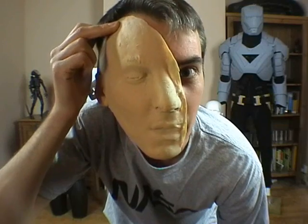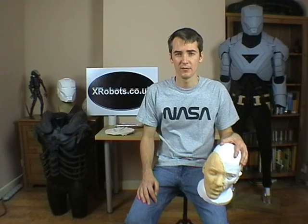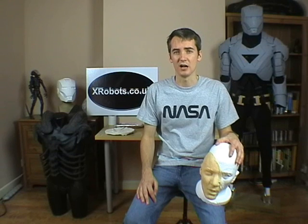In the next example, I'm going to show you how I made this quite weird mask of half my face out of latex. If you've watched my previous video on making latex items, you'll know that the best sort of mould for latex is plaster — because plaster is slightly porous and draws the moisture out of the latex, helping it dry, so the skin forms on the inside of the mould that you can peel out. However, putting plaster directly on your skin is very dangerous. Unfortunately, Alginate is full of water, so latex doesn't dry very well in it and you'll probably end up with one big wet mess.